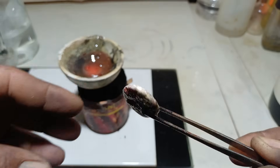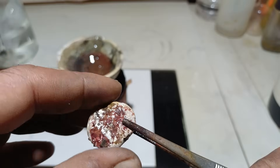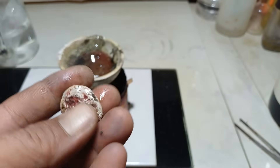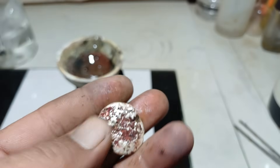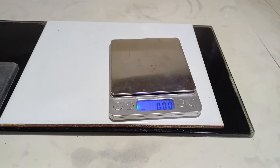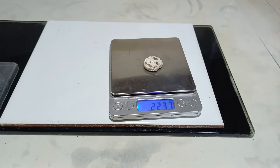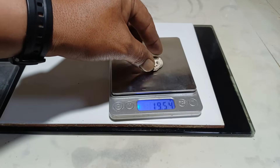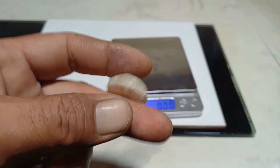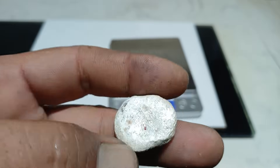That is our silver. It has some oxides here — oxidation with copper, maybe. So we clean this up and use our scale. We turn on our scale to zero. The reading is 19.54 grams — that is the silver remaining in our material. There's some remaining borax here but no problem. Thank you for watching.